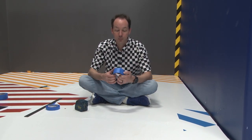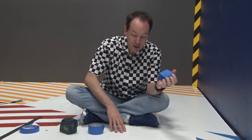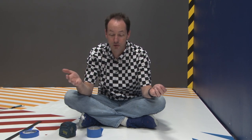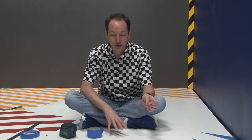Now, I'm doing tape for masking, for painting on a floor. And this floor is really rough because all of it is plywood. There's nothing special about it at all. It's a medium grade plywood where the top is really smooth, a nicely veneered stack. The inner layers of the veneer are like plywood dust, sawdust, MDF, whatever. It's got big chip fillers on the bottom where they filled the knot holes, but that's on the bottom so you don't see it. This is single surface, really good plywood.